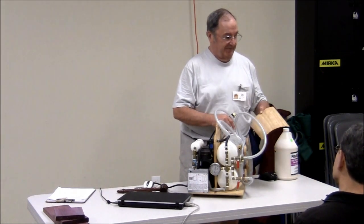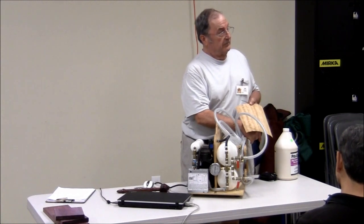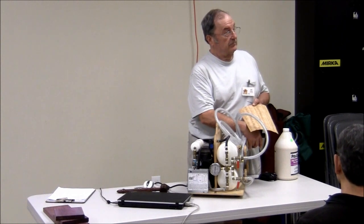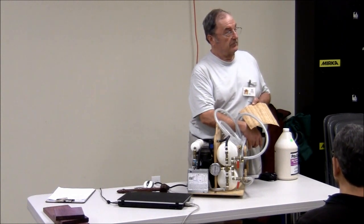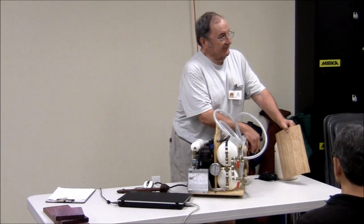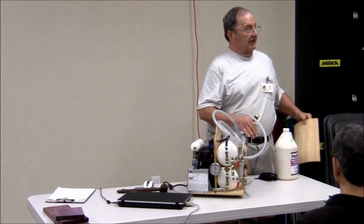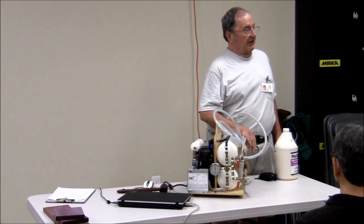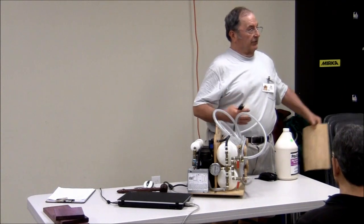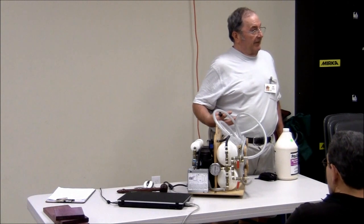He likes glue. This is mainly used for marquetry and stuff like that, but if you were making cutting boards or something where you're assembling parts together, would you use it the same way? Are you better off just clamping something like that? There's two answers to that. If you're taking blocks of wood and gluing them side to side, a vacuum system like this isn't going to do it. More of the traditional clamps, edge clamps and so forth, would be the answer there.